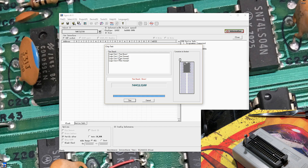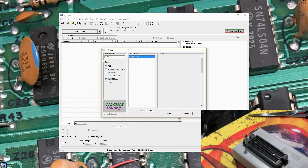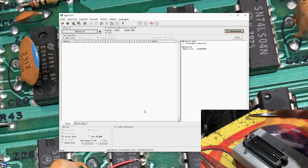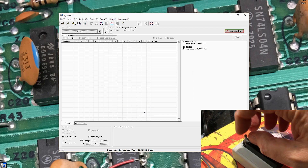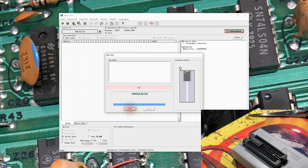I'm assuming it's just testing at 5-volt logic levels. So let's find a little more complex device. I believe these are 132s — device select IC 74132. Let's see what we find. We get a 74HC LS132. Empty socket should fail — and it did not like that.